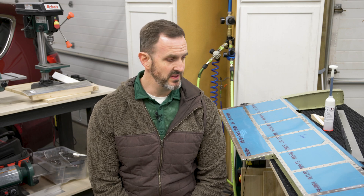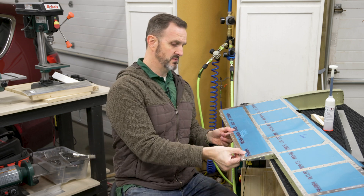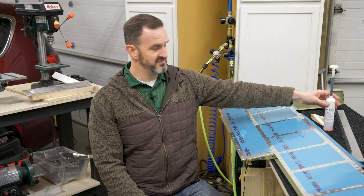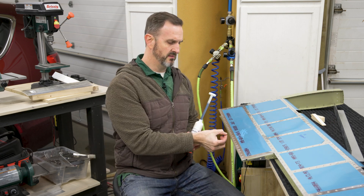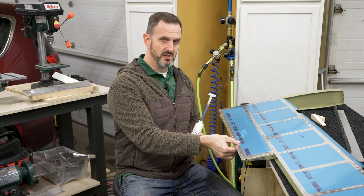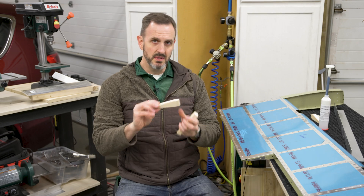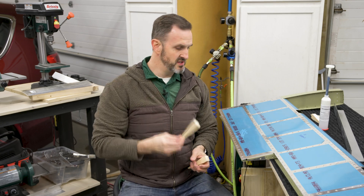Today I'm going to be doing something I've been putting off for a very long time. I'm basically going to be sealing up the trailing edge of the elevators. By sealing up I mean I need to get some Pro Seal - or I guess they call it Flame Master sealant - and basically glue this on the trailing edge wedge, as well as cleco it together. I also need to put some of that same pink sealant on these wedges right here.